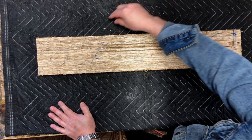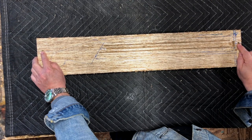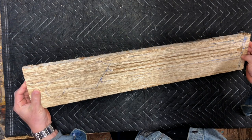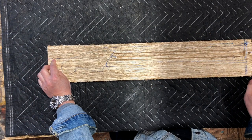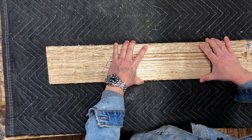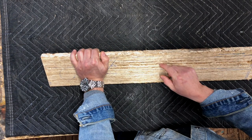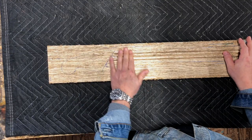So this came off the CNC. The locator pinholes were milled, and the really interesting thing — I'll get some close shots — is the bottom of these pinholes are perfect. The floor of the milling is outstanding, it's what I'd expect. The walls, however, have so much fiber there, it's really troubling.